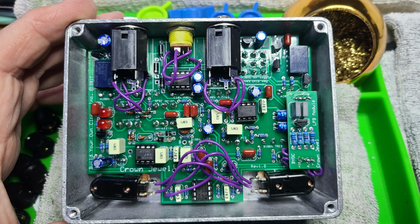And once I got everything out of the board, I soldered the power barrel back into the circuit so that I could test it every step of the way. Sure enough, there ended up being 3 issues that were all creating a problem. And it was something so minute and simple, but it just happened to be exactly the thing. Certain wires, the actual wires that you have, that in the instructions, it tells you that you're supposed to solder in after you've got the printed circuit board into the chassis. Well, sure enough, I had too much lead on those wires.